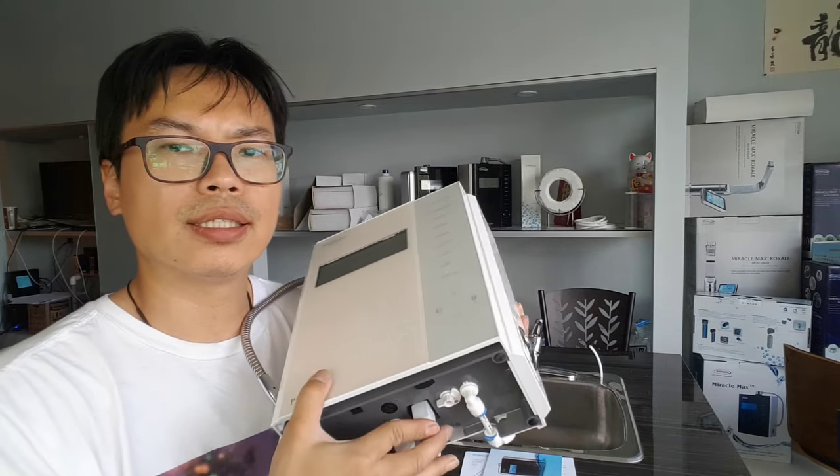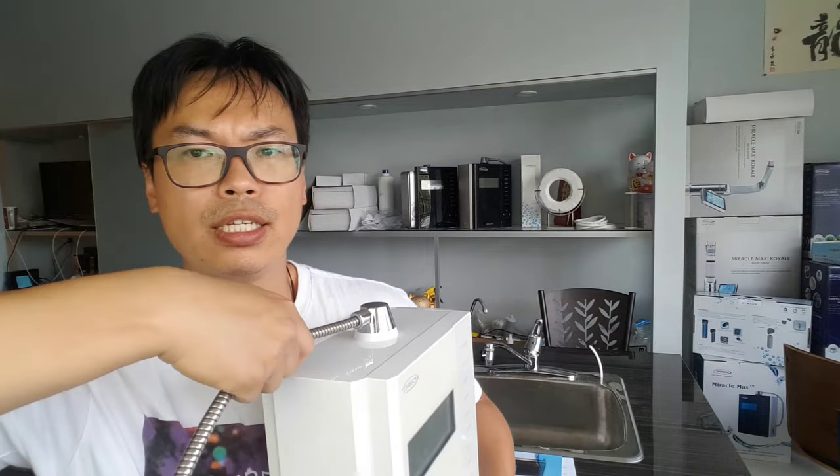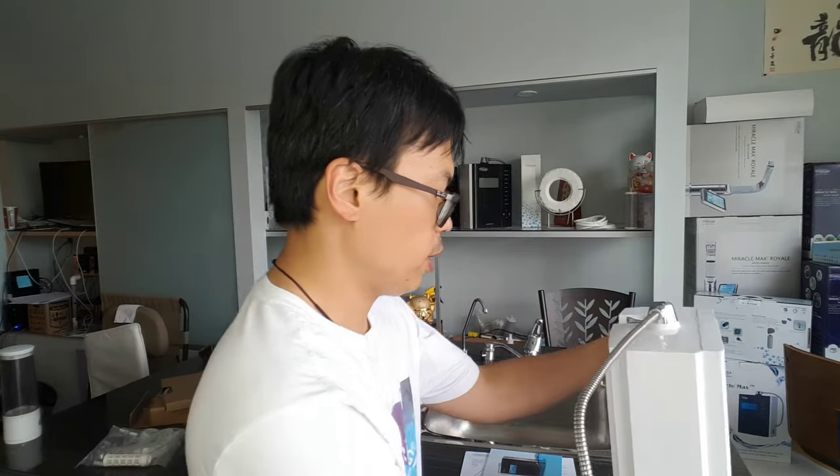Next, install the power cord to the machine — simply take it out and put it in there. That's it, done. Then this flex tube piece here — simply just screw it on. Don't use a wrench, just hand tight — good enough. If it's leaking, use a little bit of Teflon tape to fix it. Do not use Teflon tape if it's not leaking. You'll notice this thing is always limping — put it back up and tighten it with your hand wherever it's loose. It can be nice and straight; you can even flex it. After a while it usually loosens itself — it's just spring loaded.